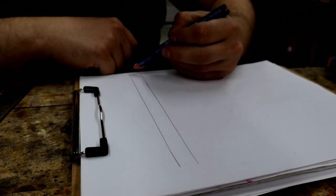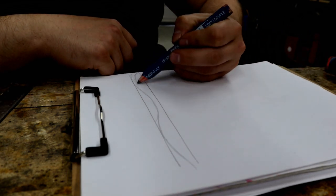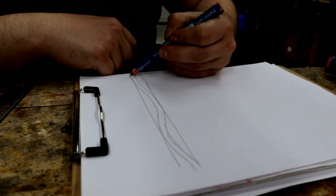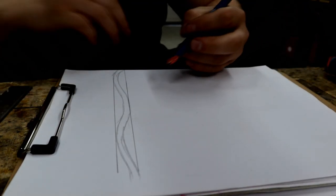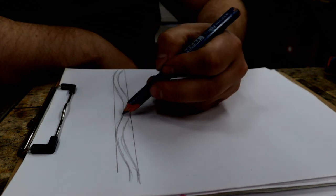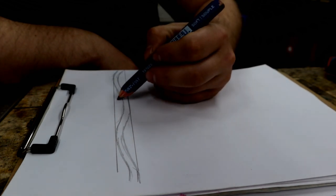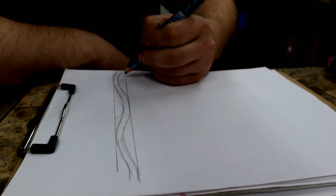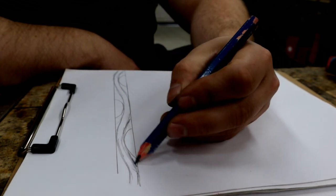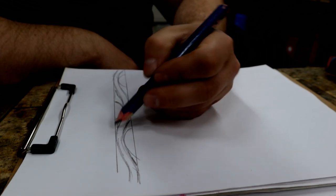In the past I've done a lot of designs where you leave a rib of steel winding, sort of snake-like, all the way down the spine. This is a really nice way to start tang filing and it's a beautiful design. I've never had a customer disappointed with it because it looks so clean, especially if you do good clean lines and get everything symmetrical. Basically, I start by cutting a notch all the way down, then mill out a little section and blend it in.